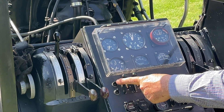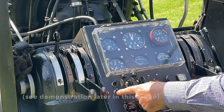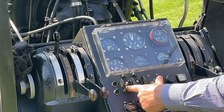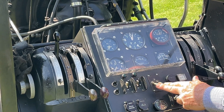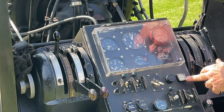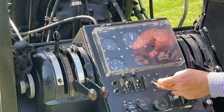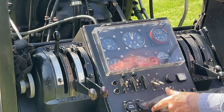On the switch panel, the upper switch is the supercharger override — I can force the supercharger between moderate and fully supercharged using the pneumatic ram. The lower one is the hot air duct ram, which operates the cowling mechanism. I have two boost coils, one on each magneto, with respective green lights to indicate activation. The magneto switches are left and right, and a panel fuse gives a visual indication of on and off — showing whether the magnetos are active or not.